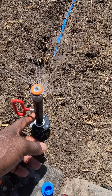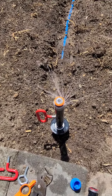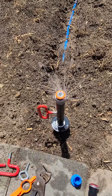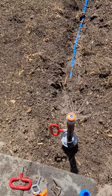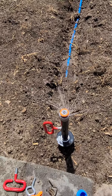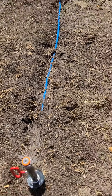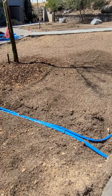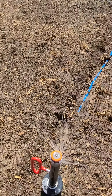You don't have to buy the whole pop-up — you can buy just the stems. Go onto Ted's website, valveheadsystems.com, and order the stems online to do a retrofit on different models of pop-ups: Rain Bird, Irritrol, Hunter, Toro. Ted has a whole line of stems for replacement, or you can buy the whole pop-up. He sells 4-inch, 6-inch, and 12-inch pop-ups — this is a 6-incher. We have different heads here in the upright position, ready to be flushed out and retrofitted with the MP rotators.